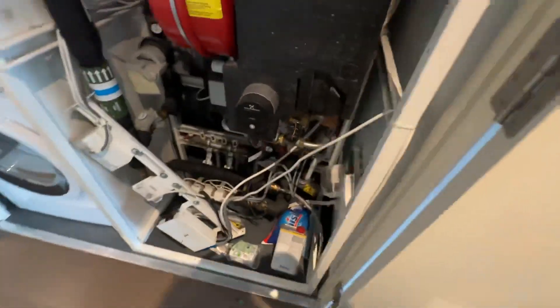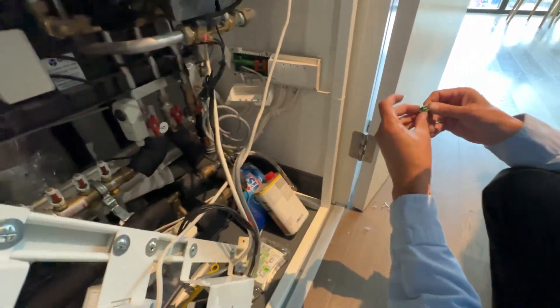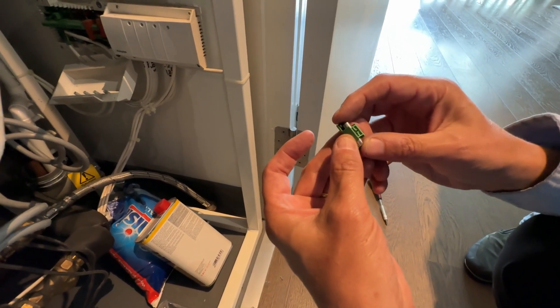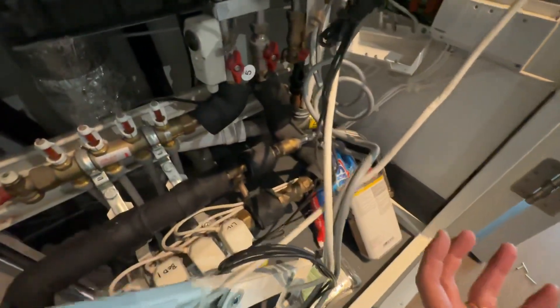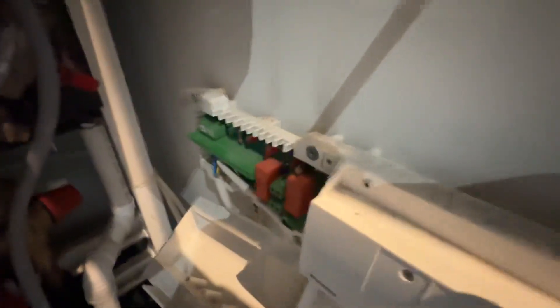The new fuse just slides in. You can see the old one is a bit blackened — it blew up. Something happened and it blew up that fuse. I'm going to take off these valves in a minute because if one of them is stuck it can put the system under tremendous pressure and blow, and this five-amp slow-blow will be the first one that goes. Let's put it back on — right in here. That's in now. So the first thing we're going to do is put the five-amp fuse back on over here and see if the lights come on or if it blows.